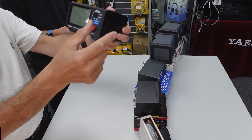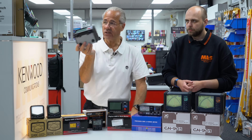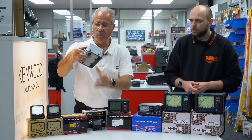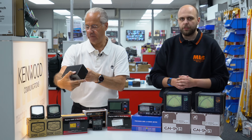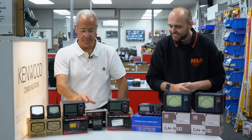The DG-103 has two power ranges: 0 to 300 watts — so if you've got a 100 or 200-watt rig like an FTDX-101 you use that range — and 300 watts to 1.2 kilowatts if you're running a linear. The same digital display as the DG-503, but only one port since it's HF and six meters only.